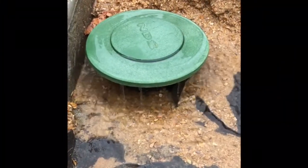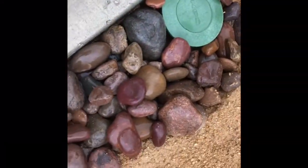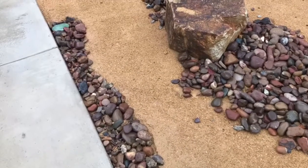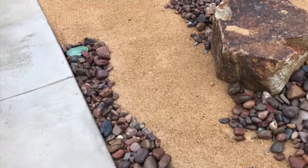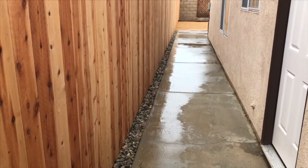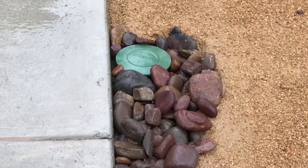Two days after the fence was completed, we had a big rain and had the opportunity to come back and see the drain in action. Running the drain all the way out to the curb is obviously the best, but here, because of budget purposes, we ran the drain out and stopped it with a pop-up valve far into the front yard, where there's plenty of slope from then on. We put pebbles around it to help prevent erosion, and it worked great. Later that week we had another big rain, and it felt good to come back and see things dry with no big puddles. The little French drain under the fence was working great. Thanks for watching.